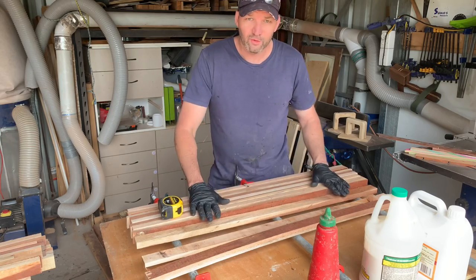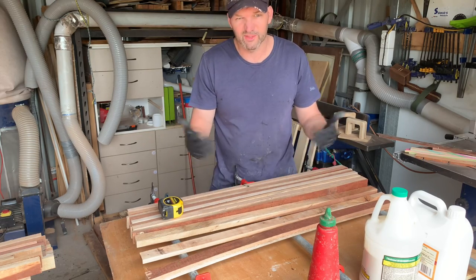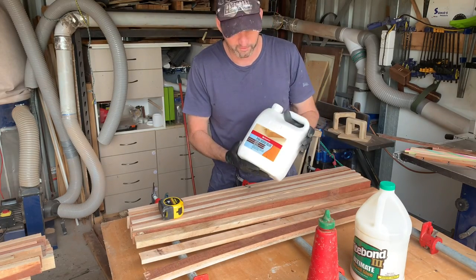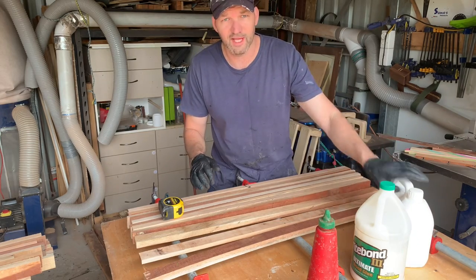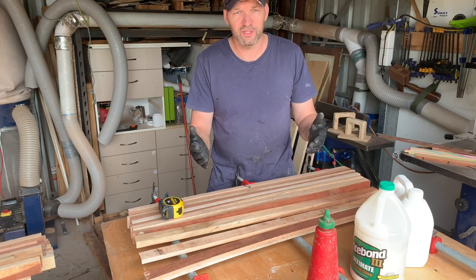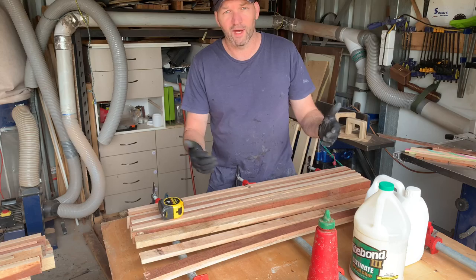I've straightened and planed all these slats flat. This is something I never used to do — I wouldn't rely on the glue alone for the structure. Now I'm doing it to up the game a little bit, and I'm going to use Type 1 glue on all of this slab work. In the past I've used a cheap PVA from Bunnings — about $28 for 4 litres — it's not the greatest glue but it has been more than sufficient. If you go back to my previous videos you'll notice I never used to plane them, just the dirty slat with cheap glue, and that was sufficient knowing I would build in heaps of other structure. It's definitely no good for outdoor use, but it's a cheaper way to have a go.